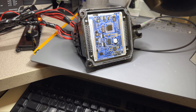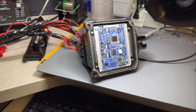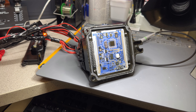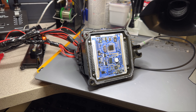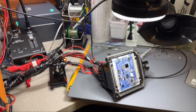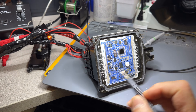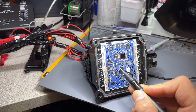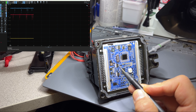The only solution I found for him is to send this to Bob to see if he can put a calibration on it and if that corrects the issue. This is not going to be either Bob's responsibility or mine because if it's the end of that microprocessor, neither Bob nor I can change or repair that. But I want to show you — I take my time to fully test the computer. All the drivers are fine because what I'm doing here is doing what the microprocessor should be doing — sending this signal — and as soon as I do it, look at the red channel going to ground, commanding that injector on.